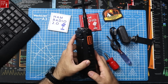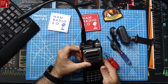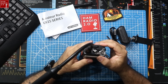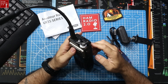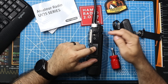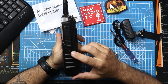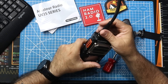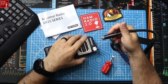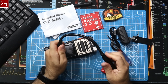I tightened those down with a screwdriver — you have to tighten them down pretty well. But then it creates a pretty good seal along here, which I assume is probably waterproof, because I think this thing is IP67 or maybe even IP68 rated. It's got this control knob on top that's protected — that's your power and volume button. The flashlight is up there. The mic and speaker are over here on this very large flap, but the proportions on the Kenwood-style connector are the same as any other radio. This antenna is kind of unique — it's heavy by itself. It's got an SMA male on the body and a female on the antenna, with a bend to it where you can bend it in different directions and fix it how you want. So it's a flexible antenna.